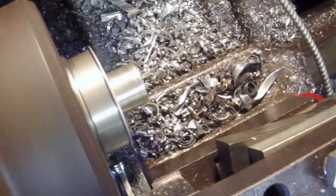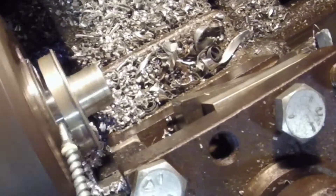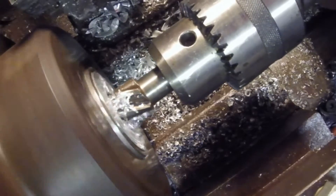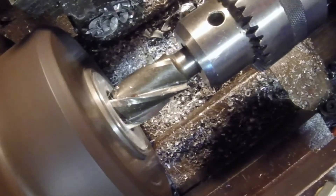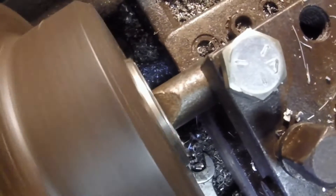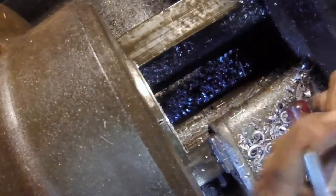Here we are parting off. And here I'm using an end mill to enlarge that hole so that a boring bar can fit in there. Because of the interrupted cut, the six flute worked really well but the four flute gave me a little trouble. I sped the RPMs up and it worked out okay. Now we're just finishing it to size with a boring bar.